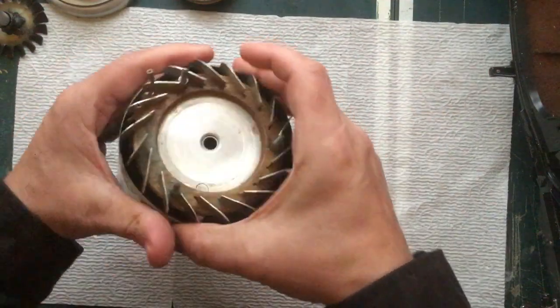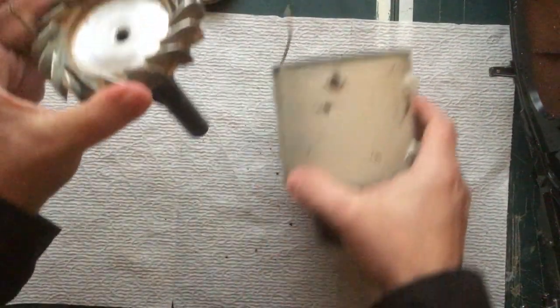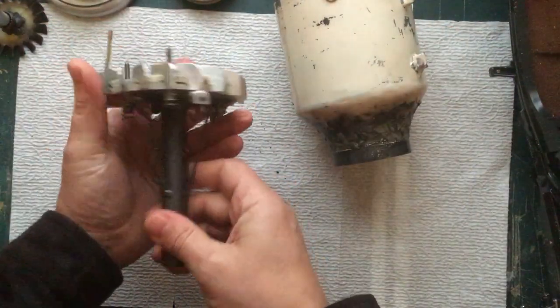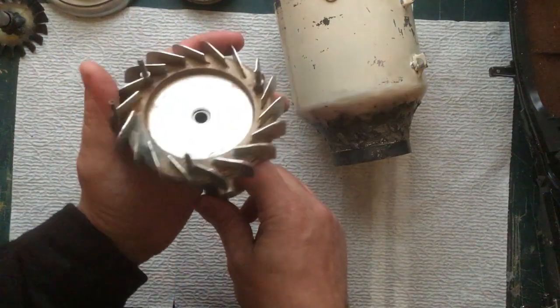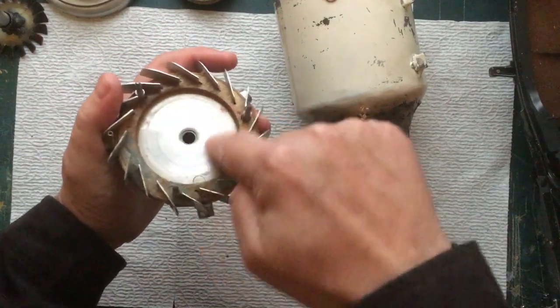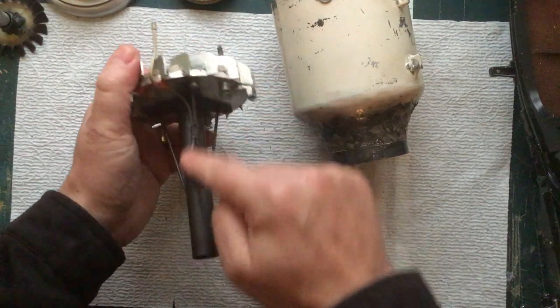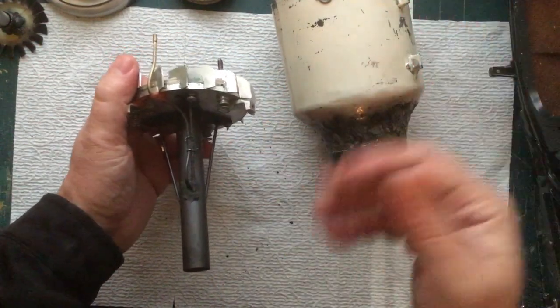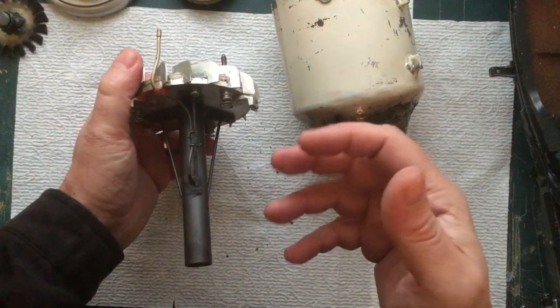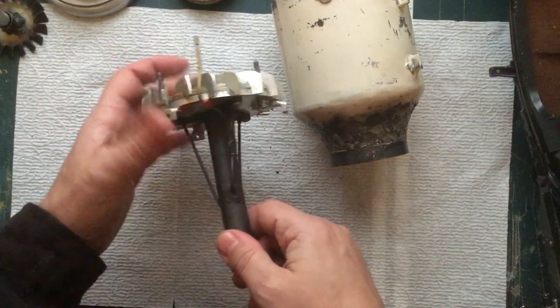The compressor guide vanes, let me see if I can push this out here. There we go. This part here is the tube for the shaft to go through. The number 1 bearing, again, is trapped in here between the aluminum plate and the steel piece here. This tube is for oil delivery. This one actually uses a separate oil tank. I know the commercially bought engines now, the fuel is an oil mix, and so you don't have a separate oil tank on a lot of them.